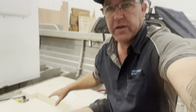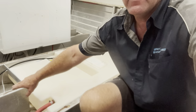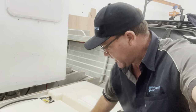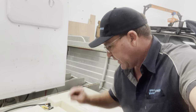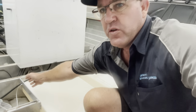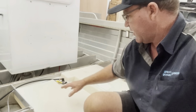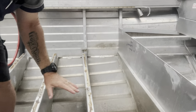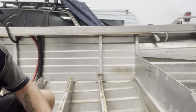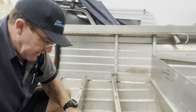We've got our fuel tank in. We've cut out the center of the gussets and replaced that with some further ribbing underneath the tank so the tank sits nice and snug onto a couple of heavy rubber planks — in a nice cradle. Some further gussets added at the back just to give back any strength we may have taken away. Now we've got a couple of seat gussets going in with spigot seats, so we're going to reinforce this area because there'll be a couple of pedestal seats sitting here. We'll also finish setting up the breathers for the fuel tank at the back of the boat.